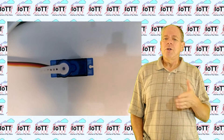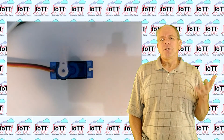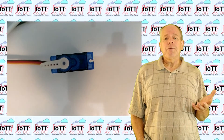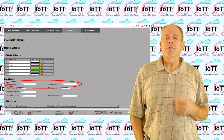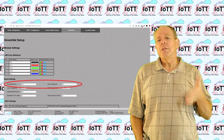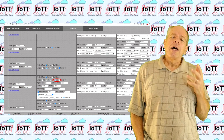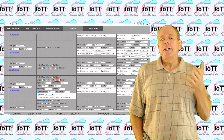90 minus makes the servo move in the first quadrant, 90 plus in the second, and 180 makes it rotate 180 degrees. Note that the exact angle depends on the servo you are using, but you can now also specify the minimum and maximum value for all servo position calculations in the header section of the setup screen. These predefined values also work if you are using more than two positions, and the angle between two positions is automatically scaled proportionally. The detailed setup is still available — to use it, simply select the individual radio button.